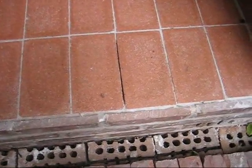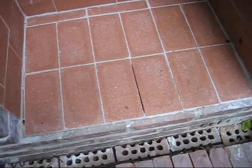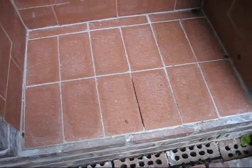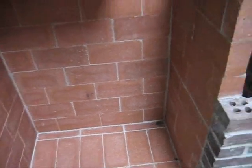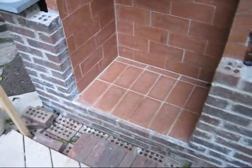I took a hose with the jet sprayer on it and just sprayed that mortar right out of the crack. And the way I'm going to repair this is I'm going to jet out some of that and then replace it with the good stuff, which for the most part is going to stay dry under here anyway, so it's not too much of a problem up high, but I'll probably replace the mortar down low.